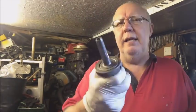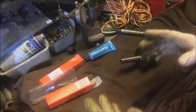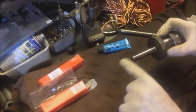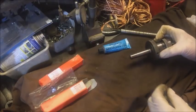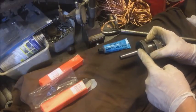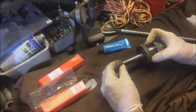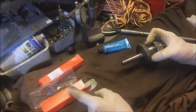So anyway, I need to know what this is. It looks like a Morse 2, but I don't really know. So if I can rearrange my beer and point you down here — if I take a known Morse taper and cover it with some blue, like so, I can stick it in, turn it round, and see where the marks are. On the Practical Machinist site it said: if you only get a wear pattern here, then it'll be a Brown and Sharp taper. If it's an overall wear pattern, because I'm sticking it into a Morse 2 sleeve, then it'll be Morse 2.